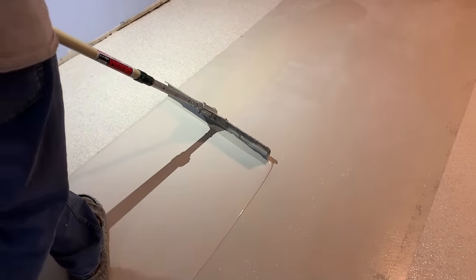I've got 48 hours on this floor — it's set enough that I'm walking in socks. I'd probably be fine with shoes but I always like to be cautious. Okay folks, I'm all done. You can see I have the furniture behind me. So this is the joint with the flake there. You can see these lines turned out pretty good — this was freehand. It's very difficult to get a perfect line but very acceptable. As far as texture — you can easily slide your hand on this without cutting yourself. It's a nice textured floor. I used about five gallons of top coat with two 500-square-foot kits for this whole floor.